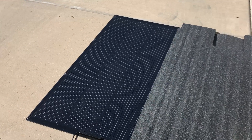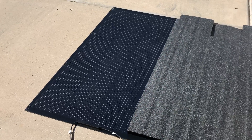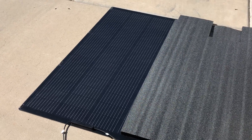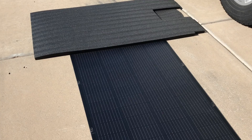I took some packing material and blocked one row lengthwise of the solar panel cells for partial blockage — that knocked it clear down to 19 watts of input. Let me move it again and partially shade all four rows and see what happens.